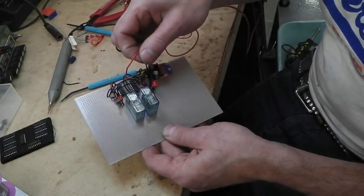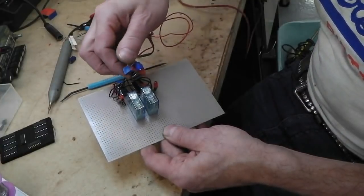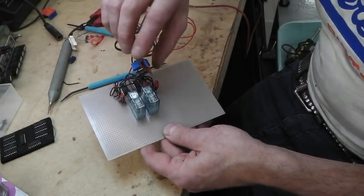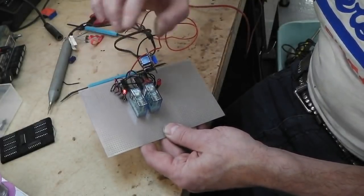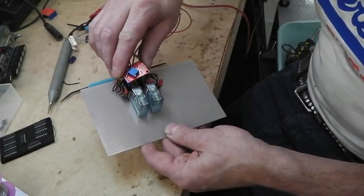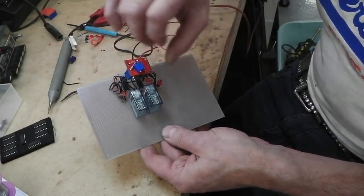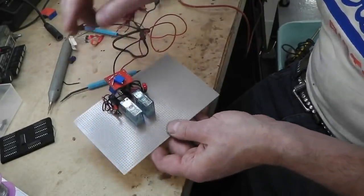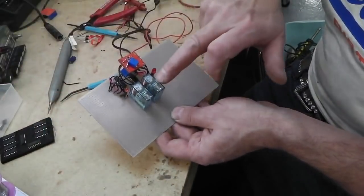It's all customizable. This now flips over the side, upside down like this. I've moved the pot to the top so that it's not out of view, and you can still adjust it. See how I've moved that trim pot just to the top of this. So that now fits like that. We can break this board there, break the board there, and you've got a reasonably sized module.